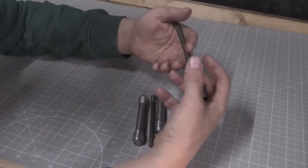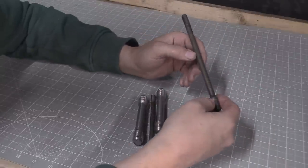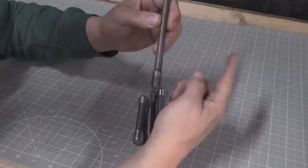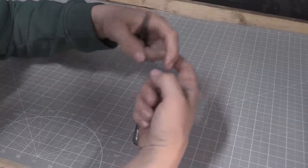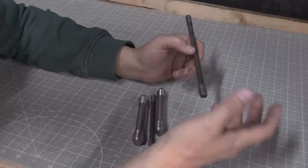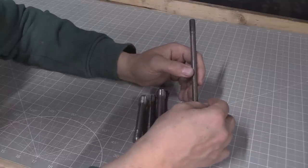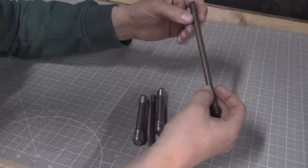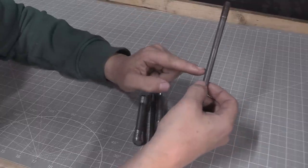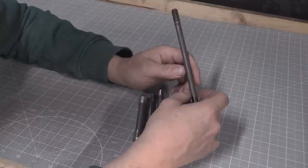And when you pull them, eventually you'll overcome that magnetic attraction, that force at a distance kind of thing, and they'll pop apart, right? And that is basically tensile strength. So the more atoms you have, all with their little magnets holding onto each other, obviously they share the load between them, just like Velcro. So that's basically what's happening: a material has a certain tensile strength, and what matters is the cross-sectional area, when you're pulling like this, right?